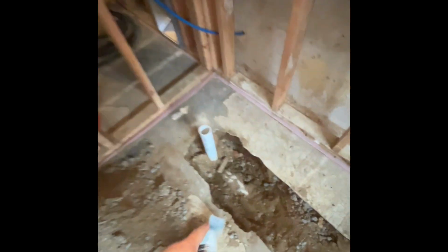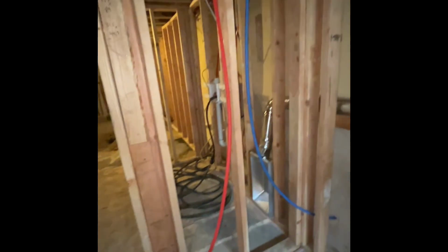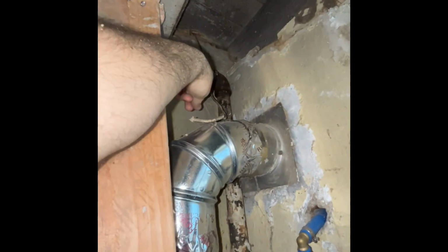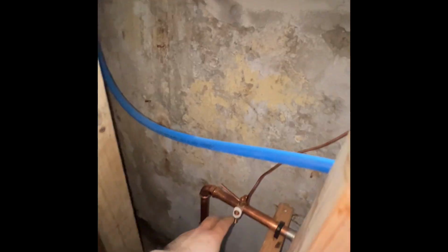Here, this needs to get recentered. You have the shower pan in the garage. Just run the mixing valve, and all the parts will be here for the shower. Okay. So for the gas line, what I was saying is run the CSST flex line from there. Just run it somewhere in here in this box. So when they come to install the meter, all the work can be done right here in this box and not, you know, have to break drywall.